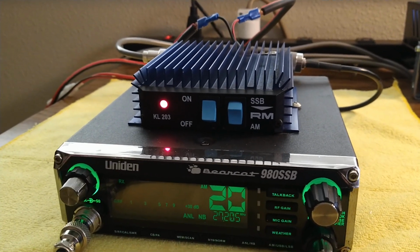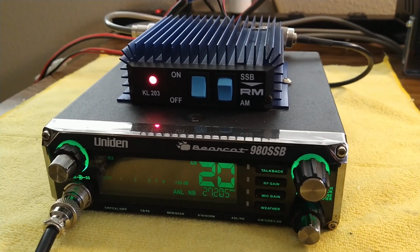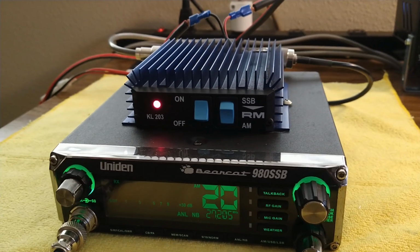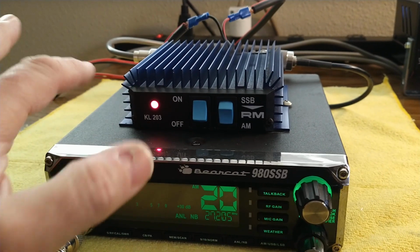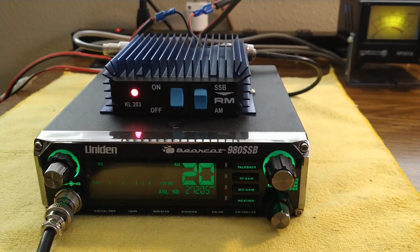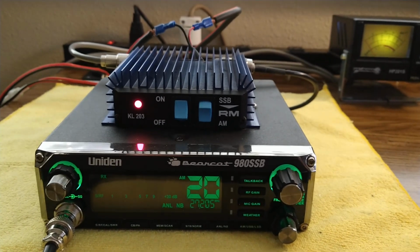But anyway, thanks for watching. I just wanted to make this video because I've had a few people commenting on the old video I made of this. I mentioned when I made the old one that the amp was buzzing, and you can hear it again now. It's either the radio or the amp, something's buzzing. What I found is when stuff is plugged into the dummy load, it doesn't matter what it is, I get that buzz out of it.